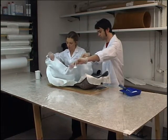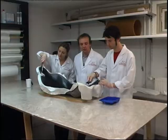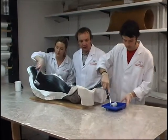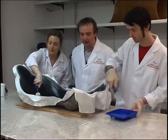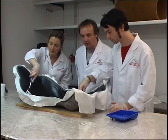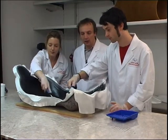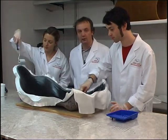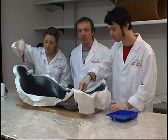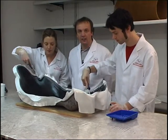At the mold line the fabric pieces overlap by a few millimeters. The laminating work involves laying the glass fabric ply by ply in the mold and impregnating it with epoxy resin. The two glass fabric plies are laid over each other so that their fiber orientations are turned through 45 degrees to each other, which minimizes mold distortion and enhances the tear strength.